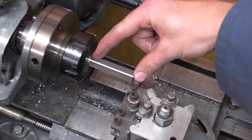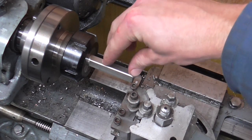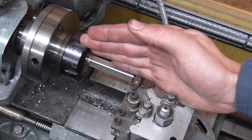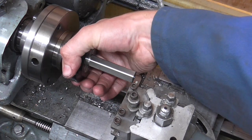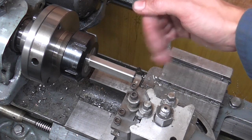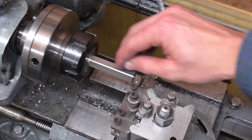You may be wondering — is this not too much stick out? Often for beginners there are rules of thumb such as no more stick out than twice the diameter, but it really comes down to the specifics. In this case it's stainless steel and relatively free-machining at that, so it's nice and rigid — if this were plastic it would push off more. I'm holding it in a collet, which really hugs the diameter and gives a better work-holding solution than three jaws on a chuck. All I'm doing is taking light facing cuts and parting, and with a narrow, very sharp parting tool I don't believe this is too much stick out.